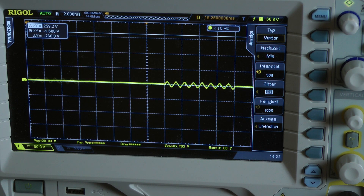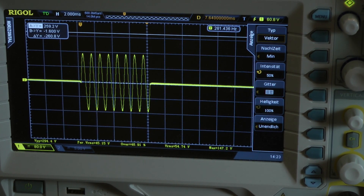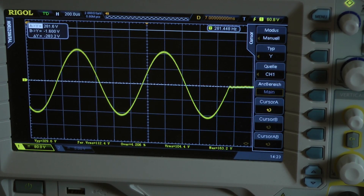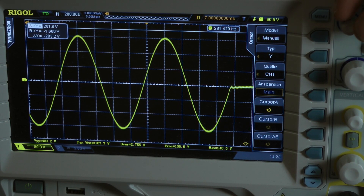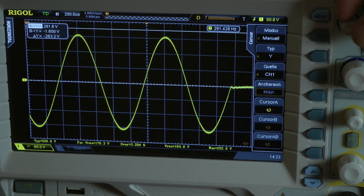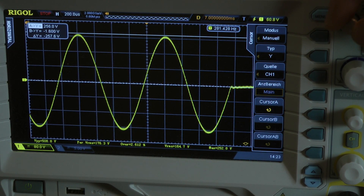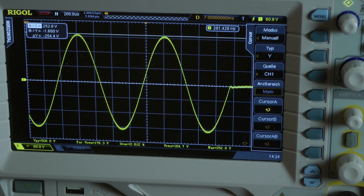Now I'm testing with an 8 millisecond burst test at 1 kilohertz. I try to catch the cycles, increasing the signal. No clipping — slightly clipped — I reduce. That looks clean; I can squeeze out a little more but I'll take this. I got a peak voltage of 252.8 volts. The amplifier delivers around 2048 watts bridged mono 16 ohms, which means around 1024 watts into an 8 ohm load per channel, both channels driven into full power.